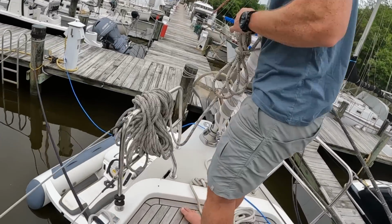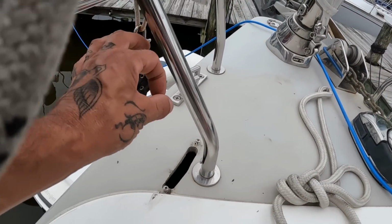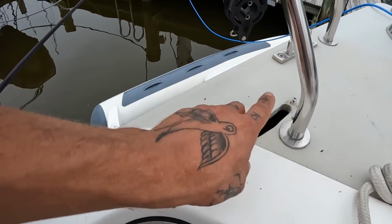So we replace this with the plastic sheave again, but then we hang a frictionless ring here. So basically the line would come from here, go through the frictionless ring and go down into that. So they'd be sharing the load. And that should take enough load so as not to break the pin inside the sheave.